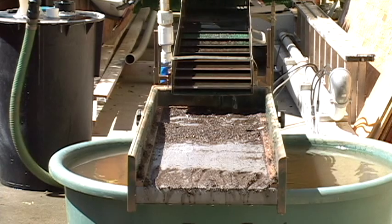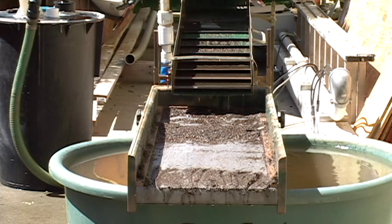So far so good. I think I'm going to need a bigger pump though — running it wide open. That lay flat hose isn't the best; I'll probably put in a rigid one because it's got kinks in it, to get the water flow a little better. Running it wide open is probably fine, but I'm probably right at the edge. I won't be able to add those canister filters to this system — I'll probably have to go to a two or three inch pump.